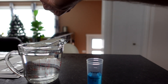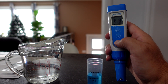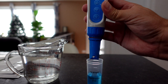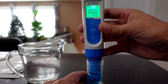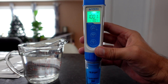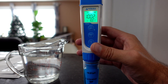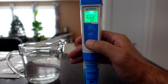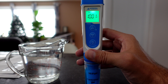That's rinsed. Push and hold calibration — screen turns green. And into the solution. Give it a swish and let it rest. Now we see a smiley face and 10.0. Once 10.01 stays with a smiley face and it's stable, push the calibration. And that's complete.